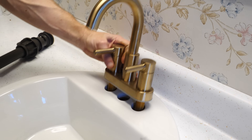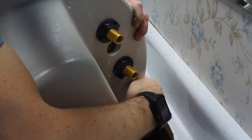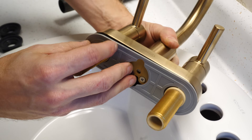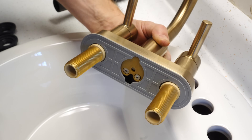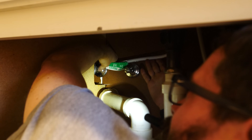Adding the new faucet is just as easy as removing the old one. You want to drop it down into place and use the retention nuts that came with it to secure it from below. Most faucets come with a rubber gasket to go in between the faucet and the sink, but if yours doesn't have that, you may want to seal around the outside of it with some silicone caulking. After you've got the new faucet firmly in place, go ahead and reconnect it to the shutoff valves with new supply lines. Depending on the type of connection you're making, you may need to add some plumber's tape to the threads before screwing them on.